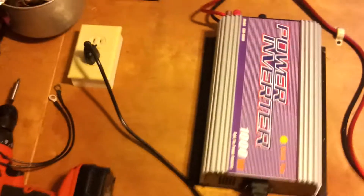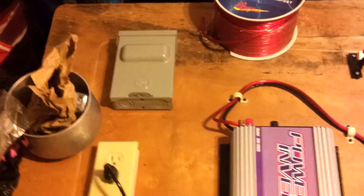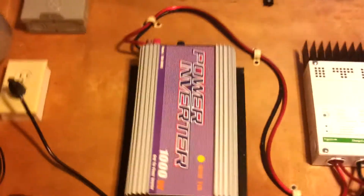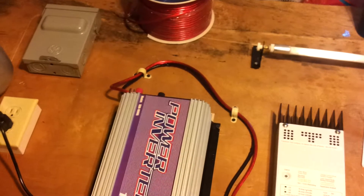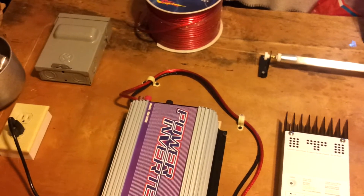I've got a power outlet and a 30-amp disconnect. I went ahead and got a blade-type fuse disconnect instead of a circuit breaker, so I wouldn't have any problems with reverse feeding. I heard that GFCIs have an issue with that, so I'm just staying away from breakers altogether and using a blade fuse.